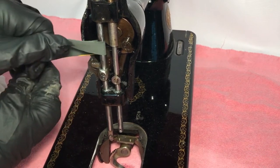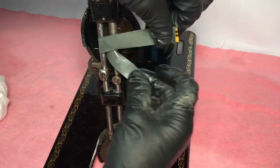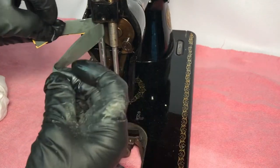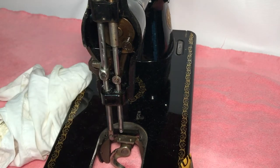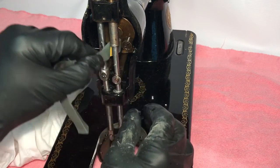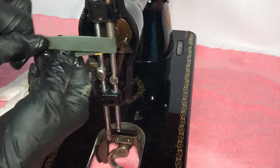I'm putting enough pressure to move the machine around. Depending how bad the rods look, this could take a while. Be sure to keep rinsing with WD-40 — this will wash out the varnish that is built up. Remember they pass through the bushings, so if they are clean they will move freely and there's less drag on the motor. With the cover on you can't see the bars, but they look great when you finish.